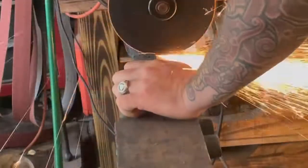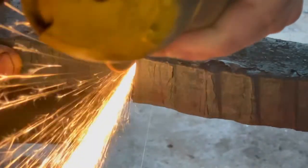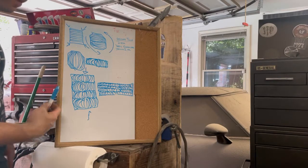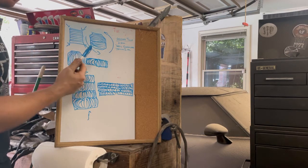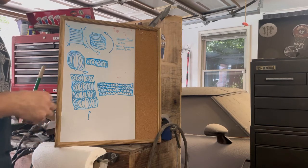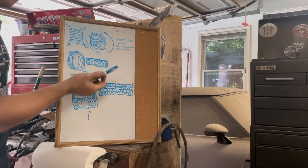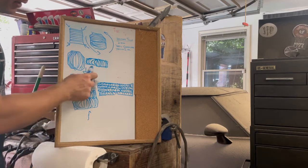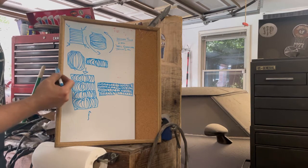Here's what I'm thinking for the pattern. We have a squared-off billet with linear layers. We're going to smash in those corners making it an octagon — every single hammer blow, hard or soft, will alter the pattern in some way. We'll smash down the corners to alter the pattern into a U-shape, then flip the billet vertically and squish it into a rectangle. Then we'll stack those rectangles into a stack of four and forge weld them, giving us what's called W's.